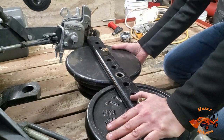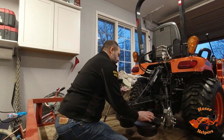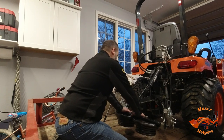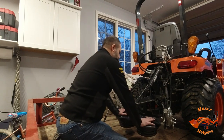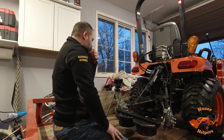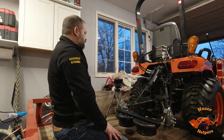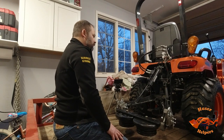You've got 50 and then 80, so you've got 130 pounds here, and then I've got another 40 pounds over on the other tractor that will go on here. I need to buy quite a bit longer bolts — I forgot to take those into account. The bar itself is probably around 20 pounds, so right now I've got about 150 pounds hanging here. When I add the other weights I'll get right around 200 pounds, and that should be a decent amount of counterweight for most loader work with the tires being loaded.